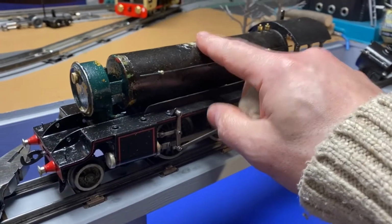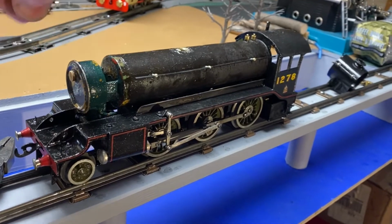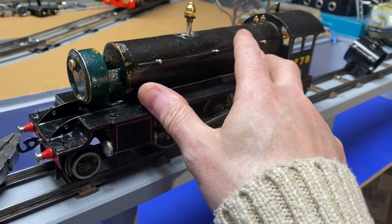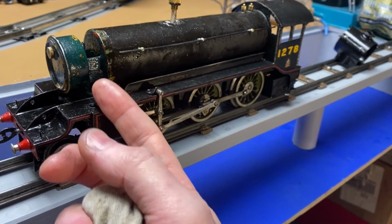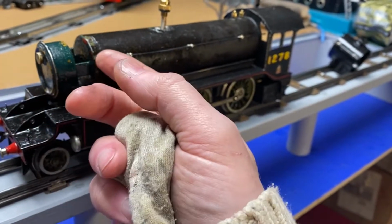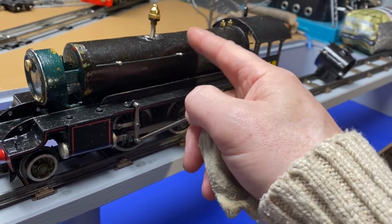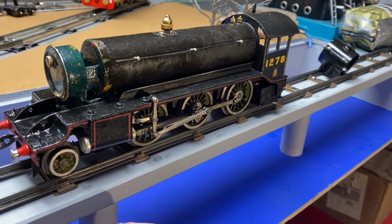But one thing I will suggest is I do tend to loosen this. I have that in there loose at the end of the run, and I leave this off, because as everything cools, if there's any condensed water, especially condensed oil and water in a steam pipe, if you leave that on there, it can tend to draw that stuff up because this will create a vacuum. You might have stuff back up into your boiler that you don't want there.